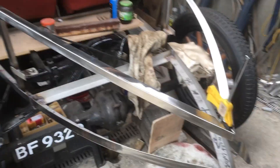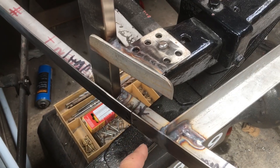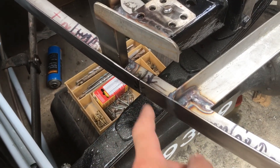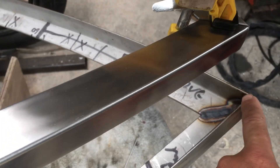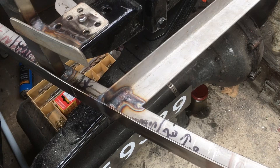Here's my framework all in stainless and it's starting to get there. I've just welded the bottom frame up, but I need a cutout all the way around here so that the spring can articulate up and down. I've welded in the cross beam and the rear end, and now it's ready to cut out.